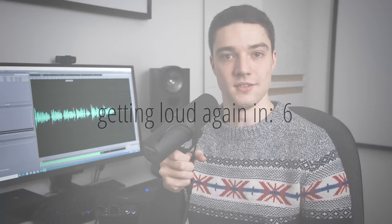Okay now it's time to check out the preamp performance of the Moto M2. For that I'm currently speaking into a Shure SM7B. This mic is known for its notoriously low sensitivity meaning you have to use a lot of gain with your preamp, which brings out the noise. So you're listening to what's pretty much a worst case scenario. Let me be quiet for a second so you can hear the noise floor of this recording. But how do the preamps on the M2 compare to other interfaces? The following recordings have been amplified digitally so you can hear the noise more clearly, but other than that there has been no post-processing done.